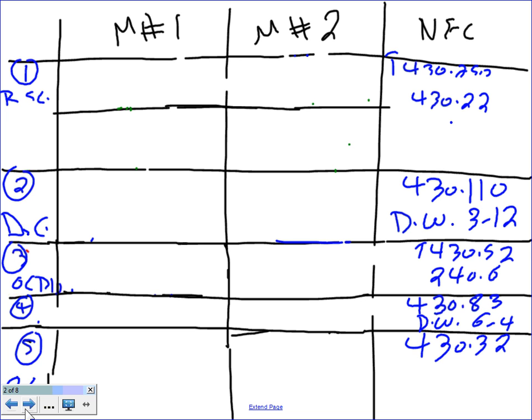So number one you're looking at is a branch circuit. Number 1 is my branch circuit. Let me read this one first. We have a branch circuit. Number 2 is a disconnect. Number 3 is the overcurrent protection device for the branch circuit. And we have motor 1 and motor 2. And number 4, what was our number 4? Contactors. Number 4 is the controller. And number 5 is the overload. Where's the conductor? The conductor was number 1, I guess. Number 1 is a branch circuit.